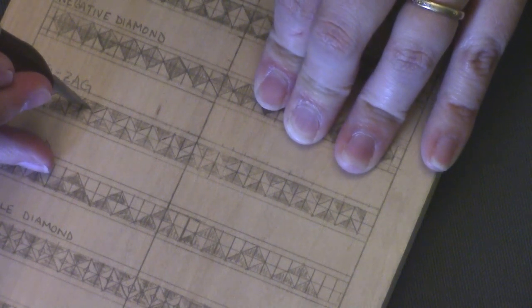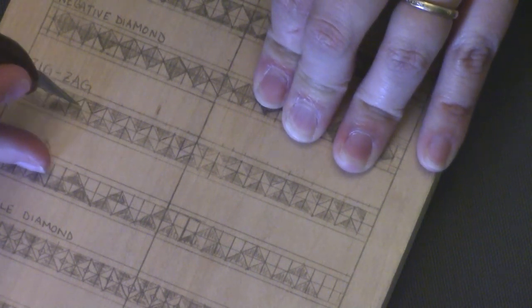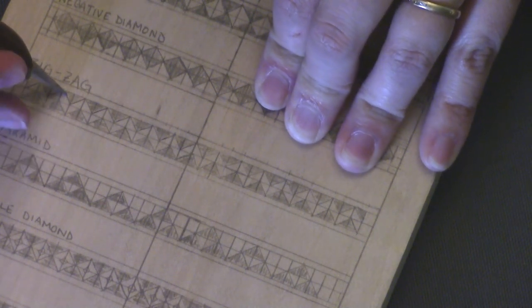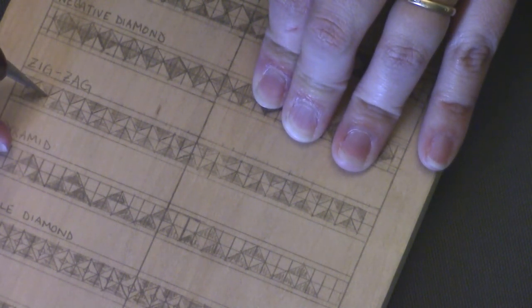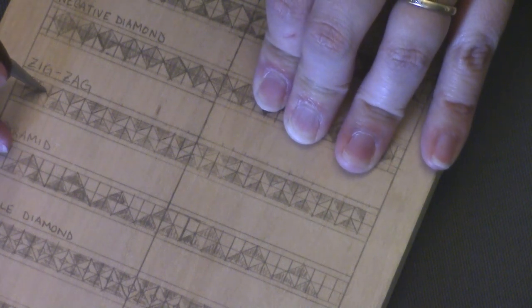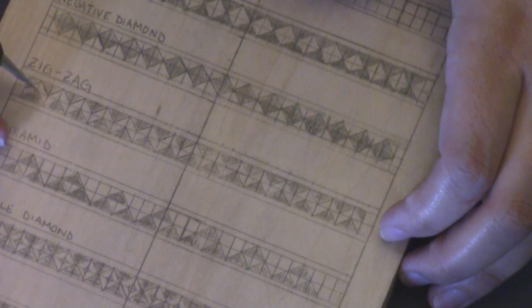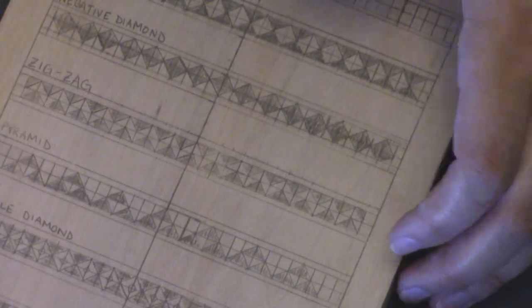When I dig in, I kind of taper in and I taper out. And I do this to try to minimize the chance of undercutting into an area I'm going to remove and then pulling off extra material. I do the flat cut last.